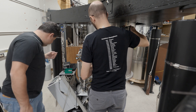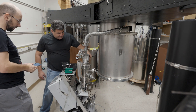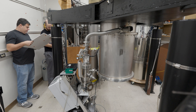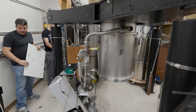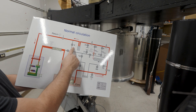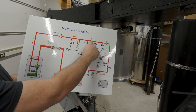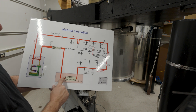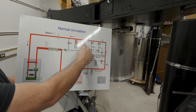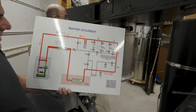You know what? This doesn't work. It works — it's just very open. Let's let it scroll down slowly. We need to turn the curtain on. We'll pump it in a moment. All right, we've got a plan. It looks like this is our pump-out port 20. In normal operation there's mix over here — you don't want to mess with it. So we're going to keep valve two closed, keep the valve closed on the front of the circulation pump, and then pump basically this entire section. We'll put a turbo pump on port 20, then open four, seven, and one. That'll let us pump this entire section out and get all the air out of there. Then when we're done with that, we'll be able to start cooling.